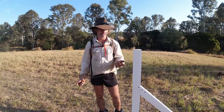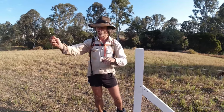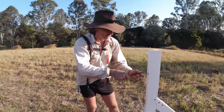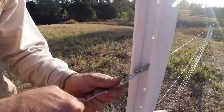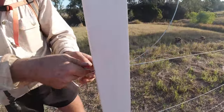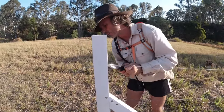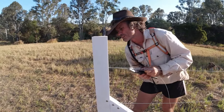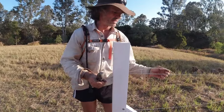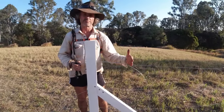To make these loops on the end with these gripples for the spring gate, it's pretty easy. Leave yourself a foot and a half of wire - I've got more because I strain from this end, I'll sort that out later. All you need to do is poke it through this second hole here and just feed it through all the way to the length you want it. Once it starts getting tight, grab your set of pliers and pull it through to what you want - I want about two inches in my loop. That's perfect. Then just wrap that wire around and tidy that up.